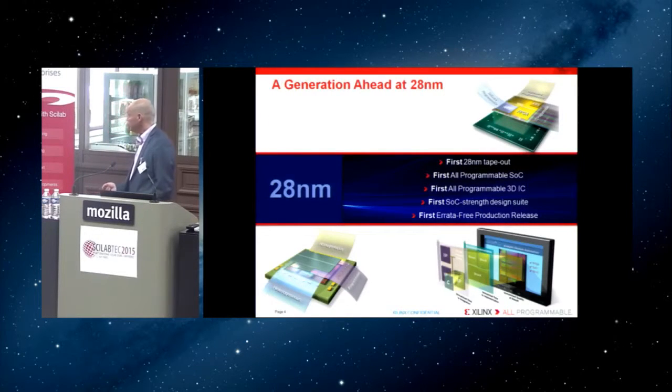What is an FPGA today? An FPGA is a combination of programmable logic plus a significant amount of processing systems. We are delivering products at 28 nanometers — a very small scale — with the ability to run and accelerate software on an embedded platform. It's not a computer sitting on your bench, but a very powerful computer you can fit inside an equipment or device. We see significant demand in the Internet of Things, because this machine is a kind of supercomputer that can be connected near your product and process tons of data in reduced time.